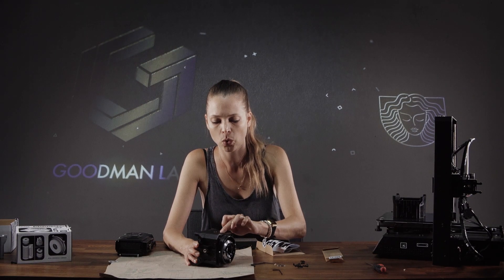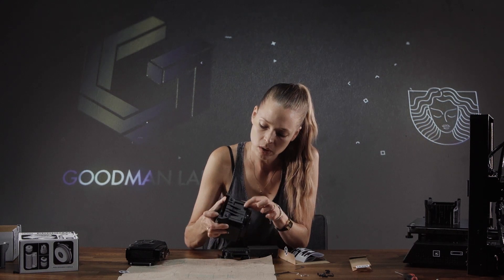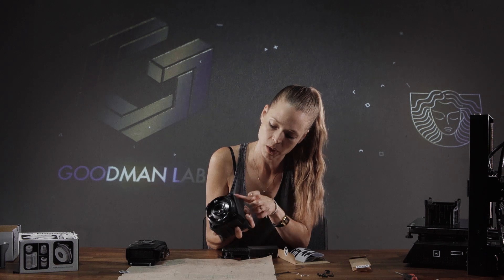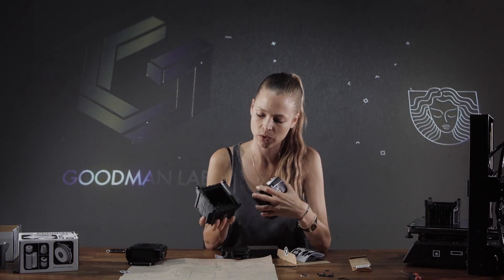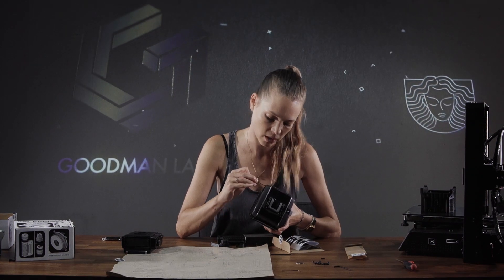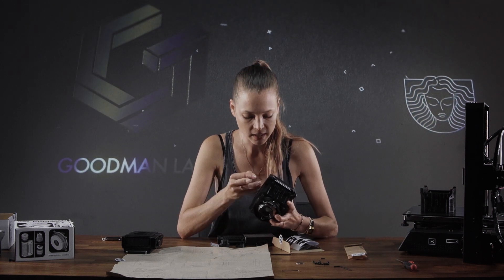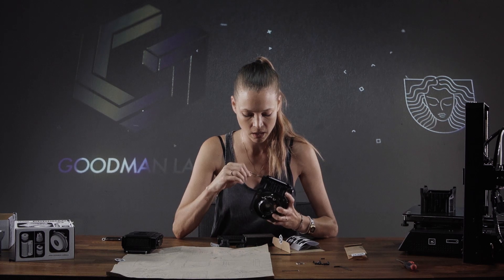The set screw in the bottom hole of the camera secures the lens onto the camera body. When using bigger and heavier Mamiya press lenses, the two holes on the upper sides serve the same purpose. On the top and bottom end of the camera you have four holes for the set screws. Make sure not to screw the set screws all the way in because you have the back — the Goodman Zone is compatible with the Mamiya RB67 back. Be extra careful when fastening this set screw; it barely has to touch the Mamiya back. This little set screw creates such force that if you overdo it, it actually breaks the body of the camera.